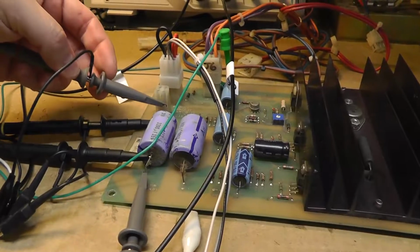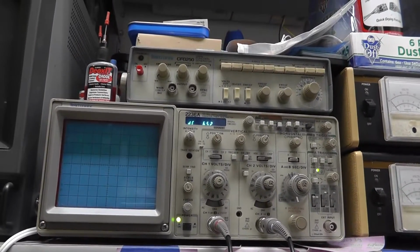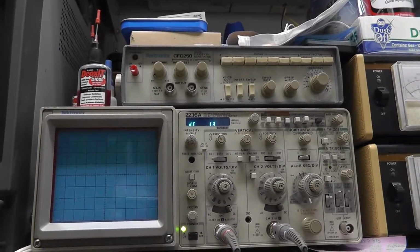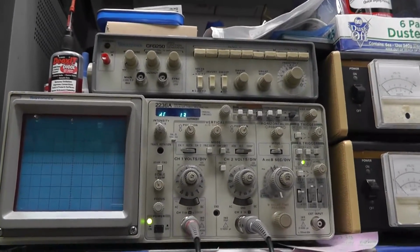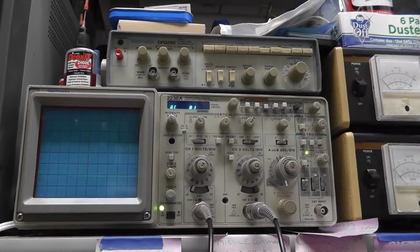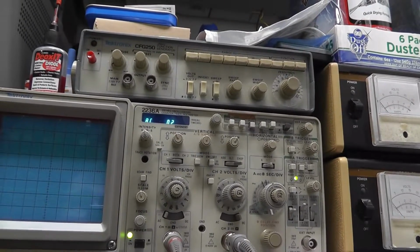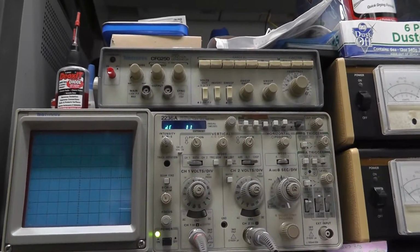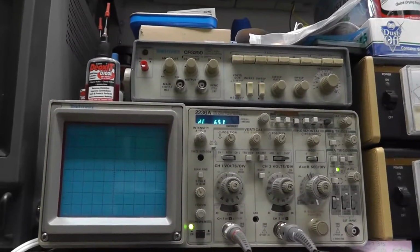I have 5 volts. Let me come to right there and see what voltage we get. 6.52 volts DC, pre-capacitor, and 0.13 post-capacitor, as you can see there. 0.13 DC volts post-capacitor. Now, can I do AC voltage? .01. Basically the same. Go to DC, 0.12 post-capacitor, and 6.5 pre-capacitor, as you can see there.